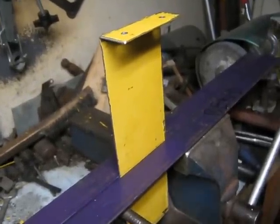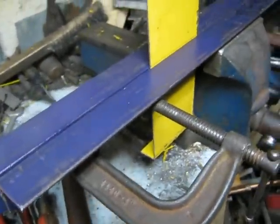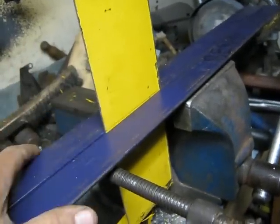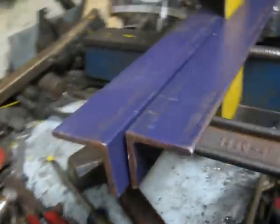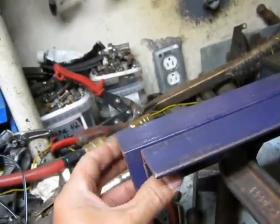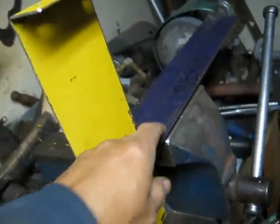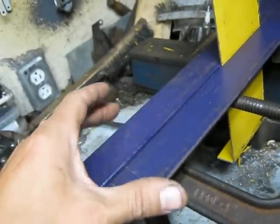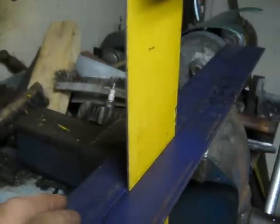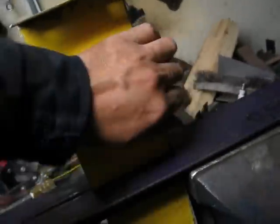Just building the oddball coupling guard here. I bent two 90-degree bends on it, but then it won't fit in the vise anymore to bend the center one, so I got my two bend angles out there. I use a c-clamp to secure them because when you clamp the vise together it spreads this end out so you've got to hold it back together. This piece here is fairly thick steel, at least a 16th inch thick.